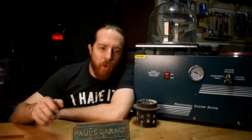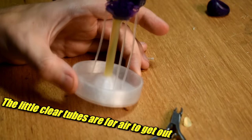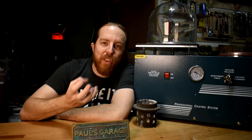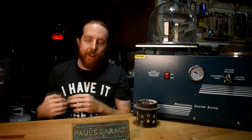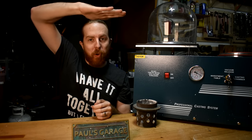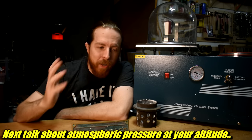So how does the vacuum improve things? When you pour metal into a mold there's air in there, and the air has got to get out. You generally need vents — in sand casting it can escape through the sand. Last time I did investment casting I used air vents, air channels for the air to get out, and I was banking on gravity to push the metal down into the mold. But this plaster is porous, so the vacuum sucks air through the plaster. When you pour the metal in, any trapped air doesn't hold the metal back. The vacuum sucks the air out so atmospheric pressure pushes down from the top to equalize, and that ends up pushing the metal into finer details that you wouldn't otherwise get.